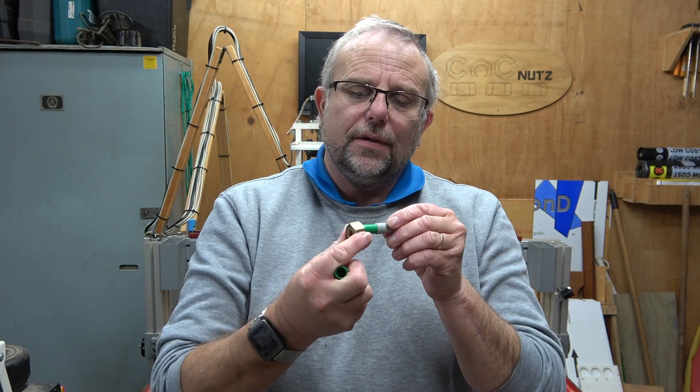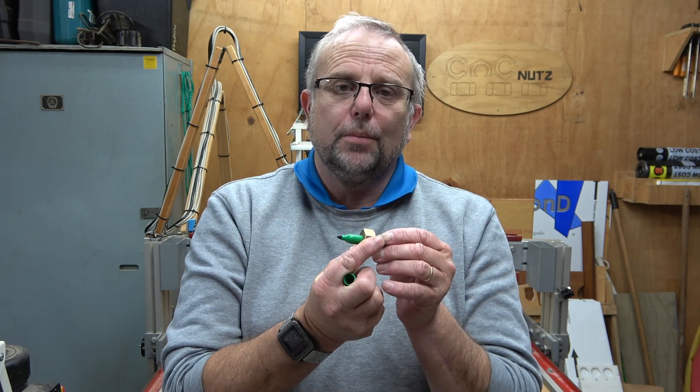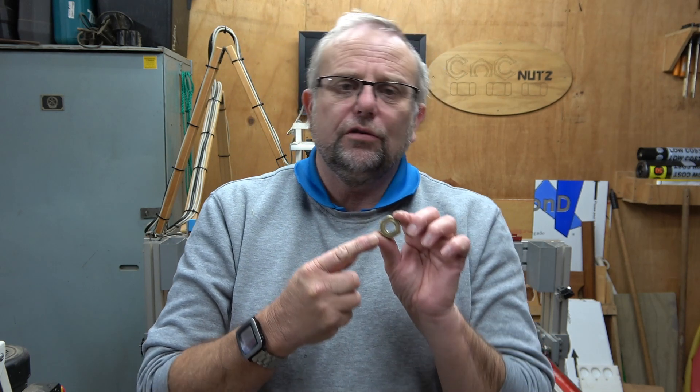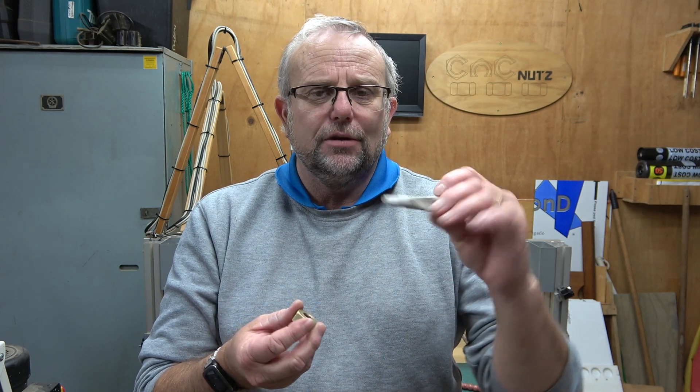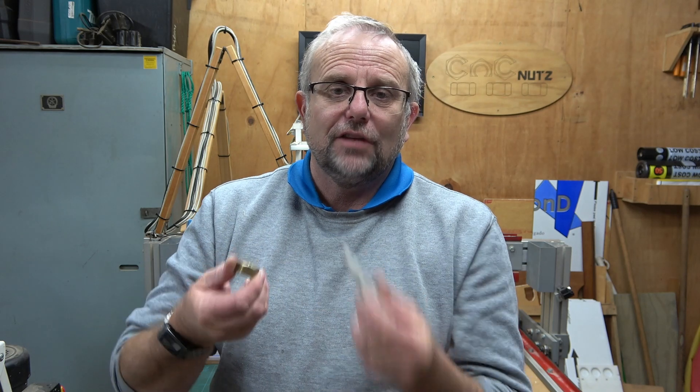Next we take our second end cap, again mark the center, and then we drill an 11 millimeter hole in it. That will allow the end of the Sharpie to pass through but not the body — that will stop it falling apart. If you find the hole is a bit tight or it's got sharp edges on it, just use some sandpaper, just roll it up in a bit of a cone and then you can use it to sand the end here. It's a very thin material; brass is very soft, and with sandpaper you can actually very quickly increase the size of this hole or simply sand the edges of it.